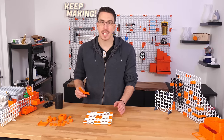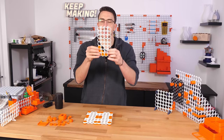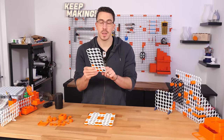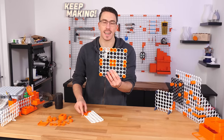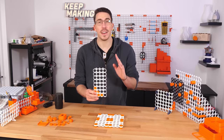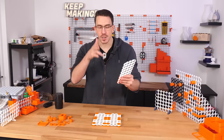When it comes to larger installations, you're going to need something like this installation tool, which is linked down below. This one works by going on to the bottom left hand corner of what you're installing, and that is the center of the holes on these little mounts. The key thing when scaling up is to make sure that the first bottom left hand tile is level — that is incredibly crucial to make sure your entire multiboard is level. Then for every subsequent tile, make sure you just check the level before you snap and screw everything into place.